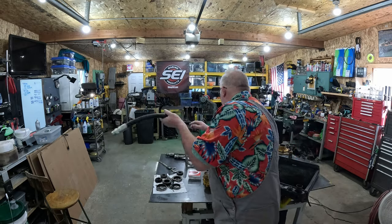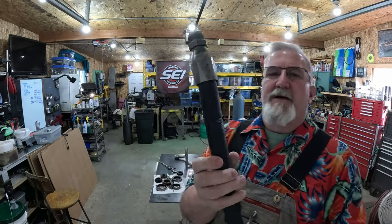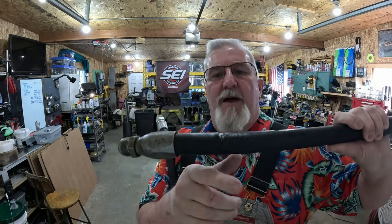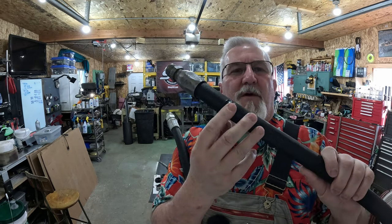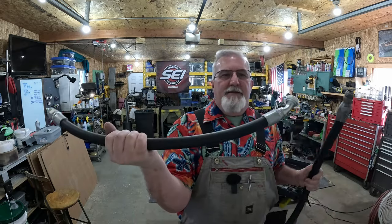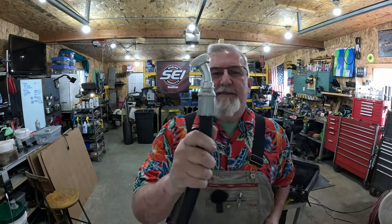Now, the original reason we went after this thing is because of this right here. For those of you that weren't watching the previous video, you can see right here, that joker there, it's got a notch out of it. It'd been rubbing against the frame a lot, till it wore through the rubber, wore through some wires, and made it weak enough that it wouldn't hold a lot of pressure. So we got a new one made. The only concern I have is we didn't have this end in stock at Napa.